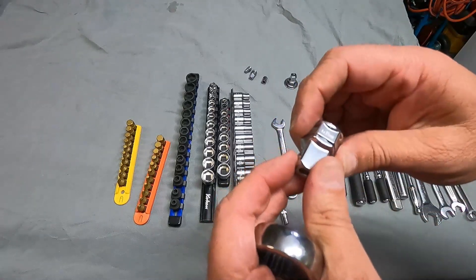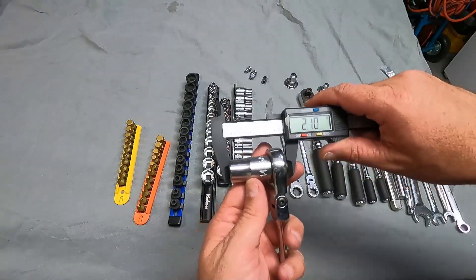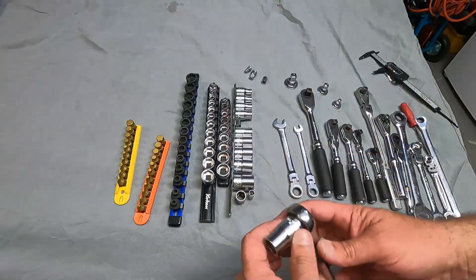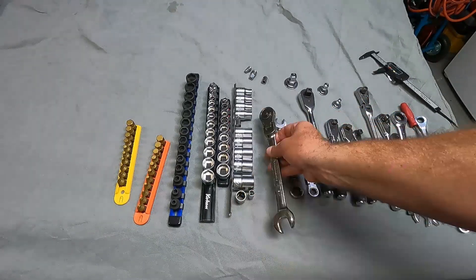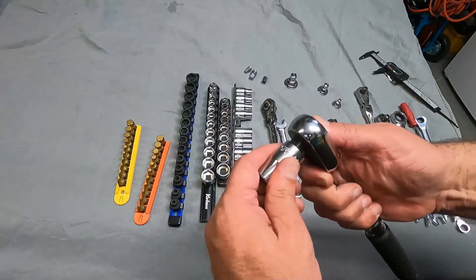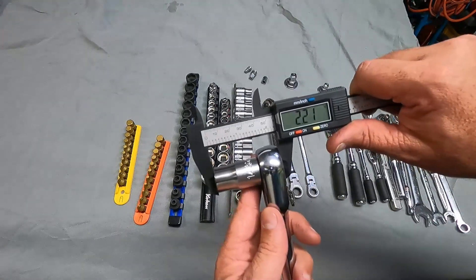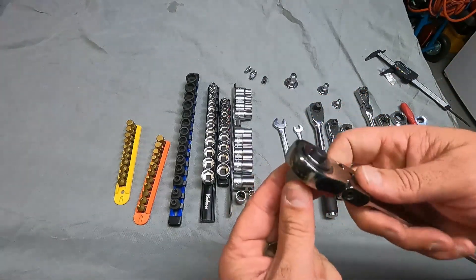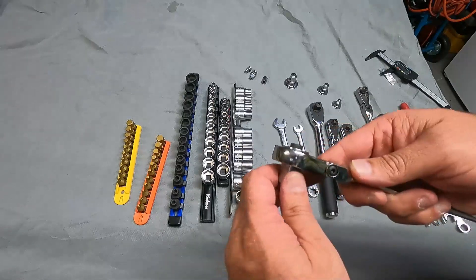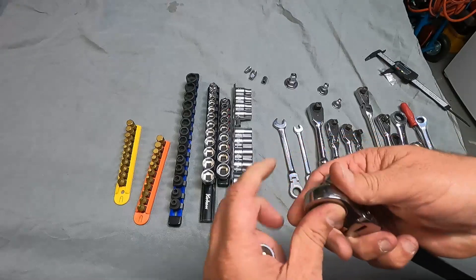This one's actually bigger — 2.1 inches. A little bit bigger than the GearWrench. Even though it doesn't have that spinner on the back, this button sticks out farther. So 2.1, and the Koken ratchet is right about 2.21. Not a huge improvement with this half-inch size, but this whole concept is pretty neat — being able to convert ratcheting wrenches into socket wrenches or ratchets.